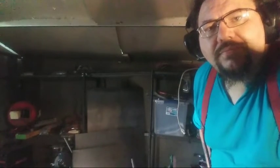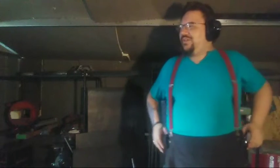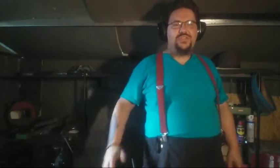All right, what did I miss while I was doing that? Oh, okay. Yeah, see, from what I've seen, hammer time, now mind you, I have no experience to back this up, but as long as you make sure that your stock is the same heat all the way around where you're drifting, it should be okay. If not, quench off the part that's getting too big too fast, and then continue drifting to even it out. Now, again, this is just theoretical knowledge. I haven't actually done this, but that's what I've seen.